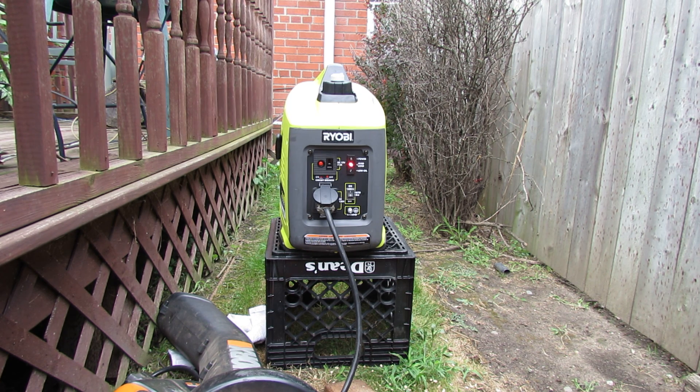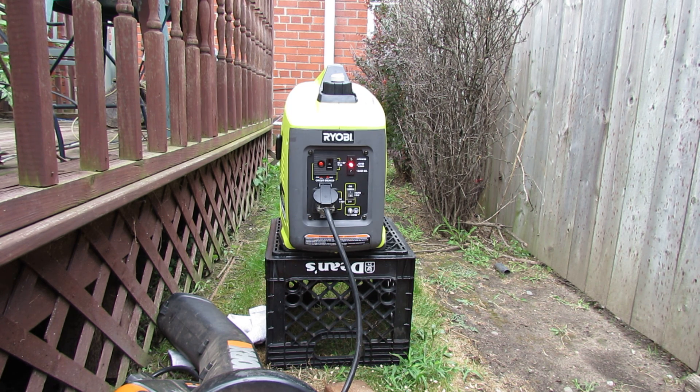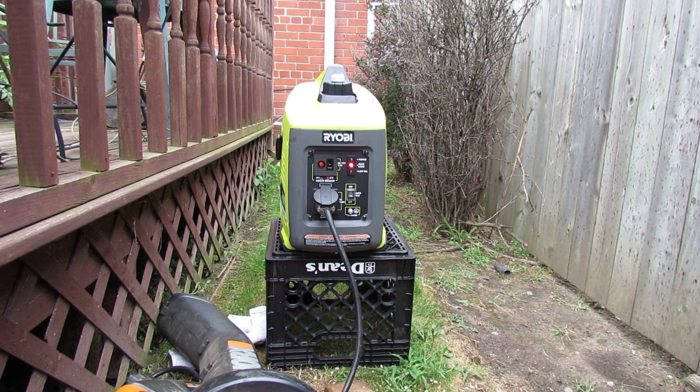It has a safety, and I'm actually glad it did that, because in some cases more traditional generators allow you to overload them — you can damage the wiring for the plug in the generator as well as the windings in the engine. To reset this, we just have to restart the engine. Let's go ahead and test the fridge out.